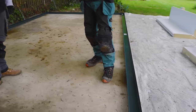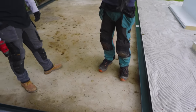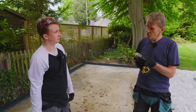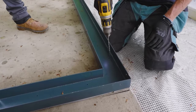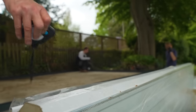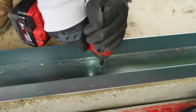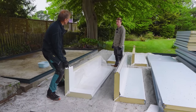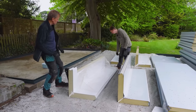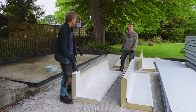You might think about using an SDS drill to speed things up — it's definitely faster. But even though I might be tempted to use one in some spots, I wouldn't use one everywhere. The important thing is we've got to peel back the polythene cover on both sides of each panel, because if we don't, when it goes into the track it's a nightmare to get out.